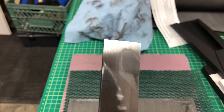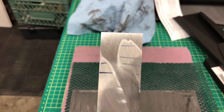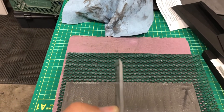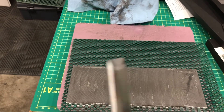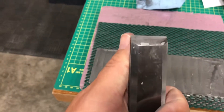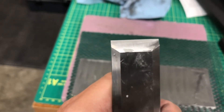I went at this thing with my diamond stone - you can see where I've really made some dents into it, and the grind on this thing is not particularly great. I'm gonna leave it there because I'm not that great a worker. I'm not worried about bringing it back to perfectly flat all the way down, as I'd lose a lot of metal off the tip. I think this is good enough to get a good primary bevel and a good flat back so the primary and secondary bevel will come out well. Man, it took a long time to get these things going.